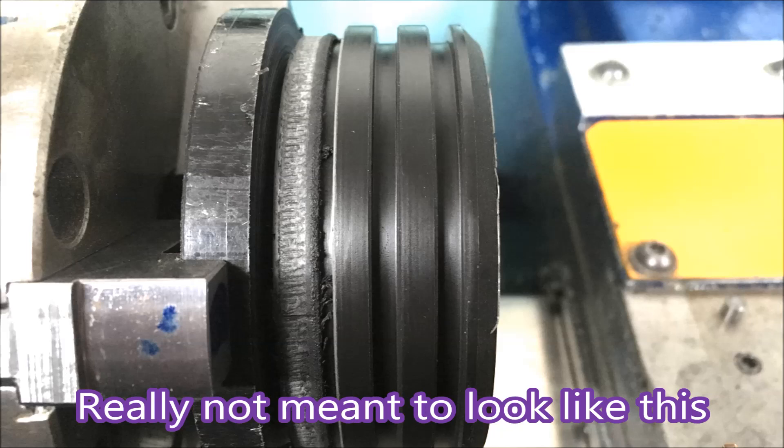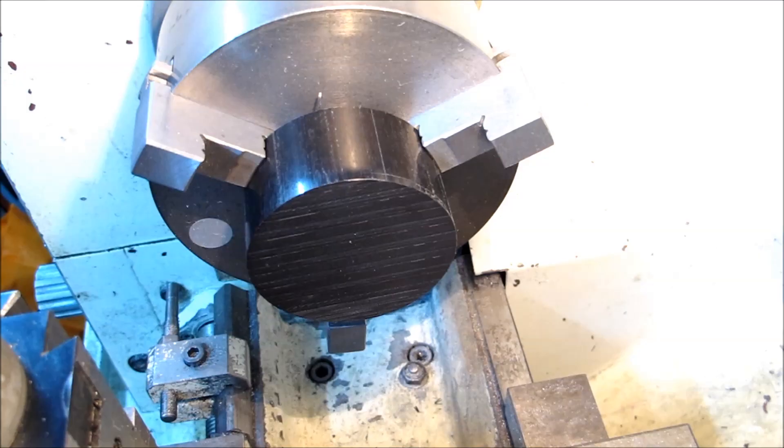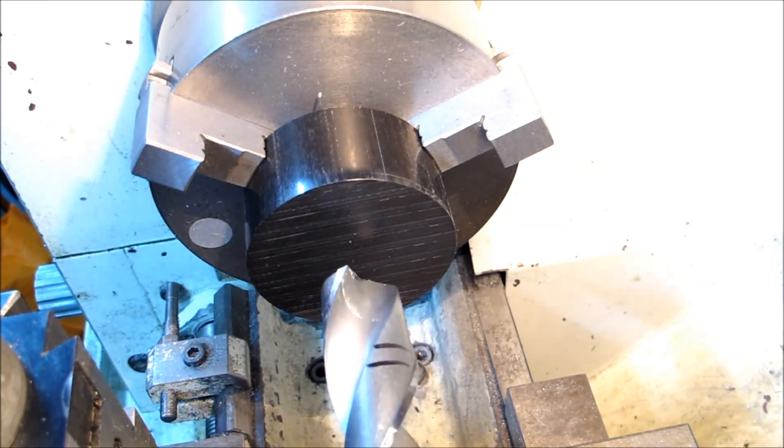I was using a parting tool that was too short. My parting tools have this reinforcing web down the blade, which makes it hard for them to penetrate any more than the actual diameter they're supposed to work with. You can see it at the bottom of the picture — it makes the parting tool so much stronger than the cheap ones where it's not there, but it does limit how much penetration you have once you go above the recommended maximum diameter.